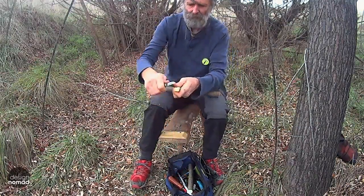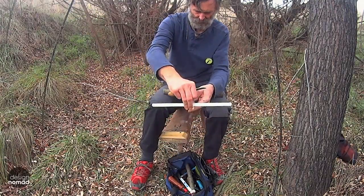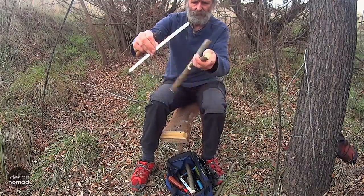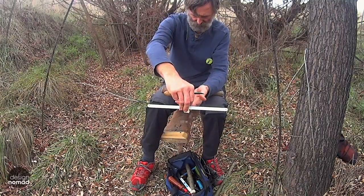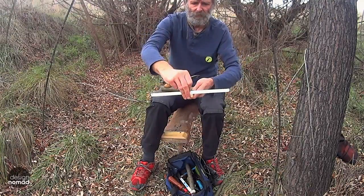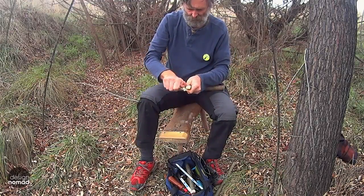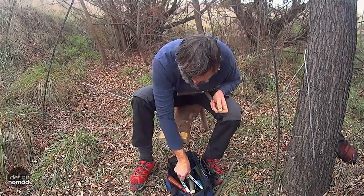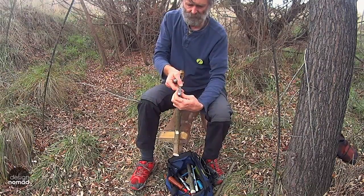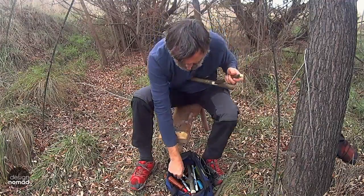And it's just very slightly trapezoid this way. If you hold the back of the blade on there like that, that'll tell you that we've actually dipped this way. And if you hold it on there like that, that's pretty close to parallel to this board here. So we know that we need to take some off this edge here. Test it on the chisel. Oh, we're getting close. A mil to go there. We'll take it off the side next, but we'll just check.